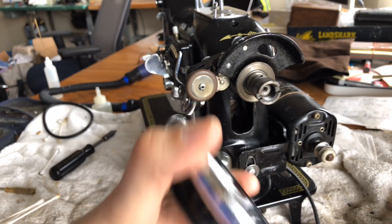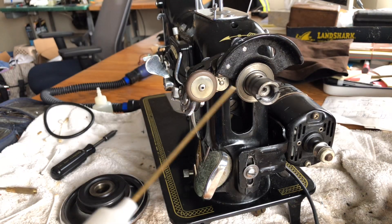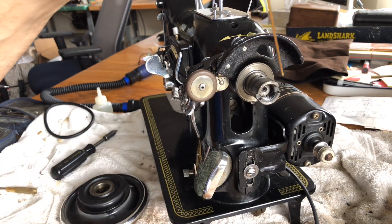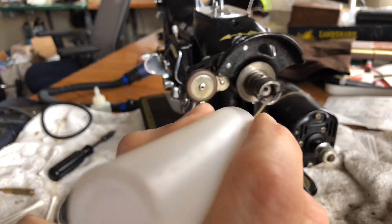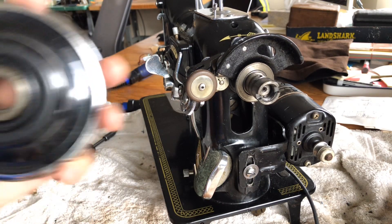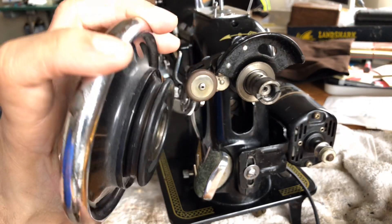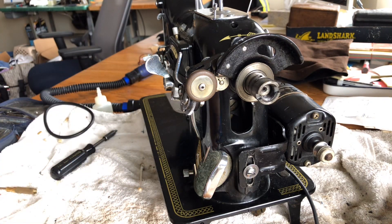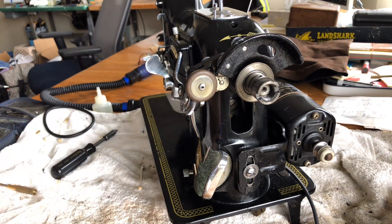On the hub itself, this is a good place. Once you've inspected and you're not finding any thread jams, you want to make sure you're putting oil. This is an area that you don't oil as part of your normal oiling. I like to put a drop or two of oil on the threads of this shaft and up top. And if you really want to be picky, you can go into the center of your hand wheel, which is really a big pulley — you can see the groove here for the belt. I've already put some oil on the drive shaft; you can put a little bit on the inside of the hand wheel. Just a little bit — don't go crazy.